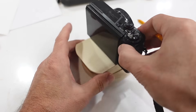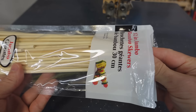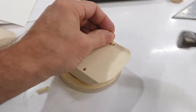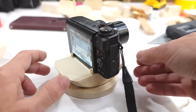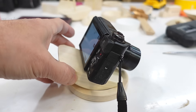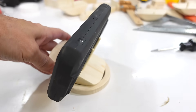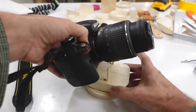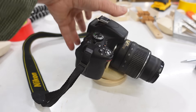Now I need to locate the pins that keep the camera from sliding off. As long as the camera's center of mass is about the center of our sphere, this thing will be perfectly stable in any orientation — aiming up or aiming down, with the pegs on the downward side so the camera doesn't slide. I also made one for a phone-like thermal camera which can tilt down or tilt up. I tried one for my big DSLR, but getting the balance right is tricky because the camera is a bit top-heavy, so I'd need to make a bigger one for that.